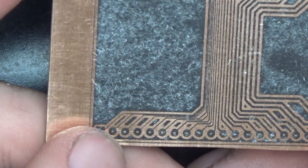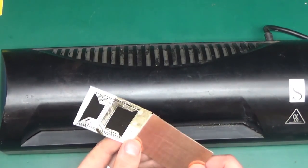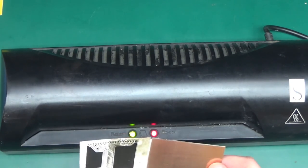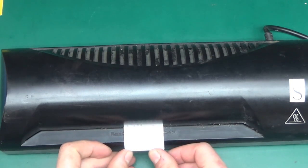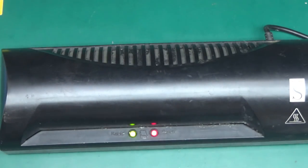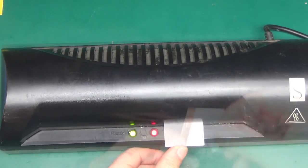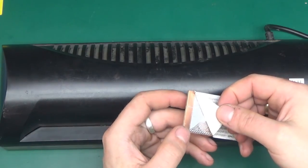Let's clean the board and try the magazine paper — glossy magazine brochure paper. If this works that would be nice because this paper is essentially free — it's called junk mail. Into the laminator for about 5-6 passes. And to give it the same conditions I'm going to spray this with some water too. That almost peels right off, leaving just a thin layer of paper on where the toner was.